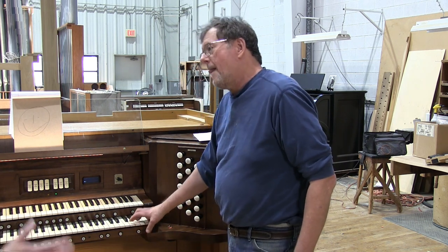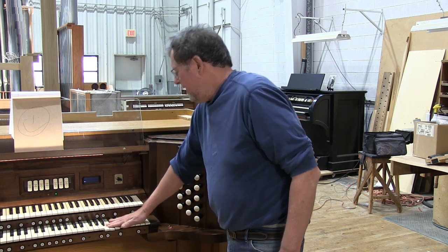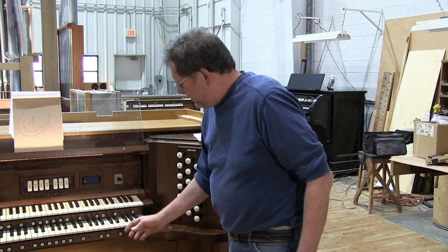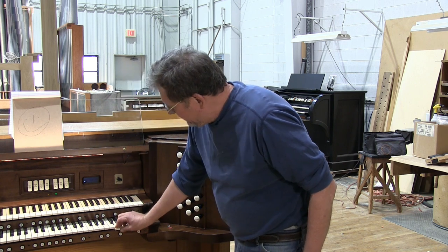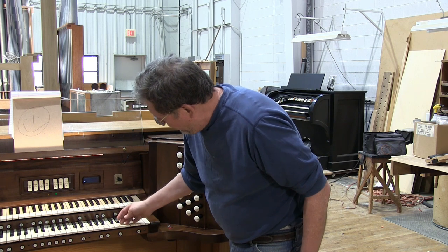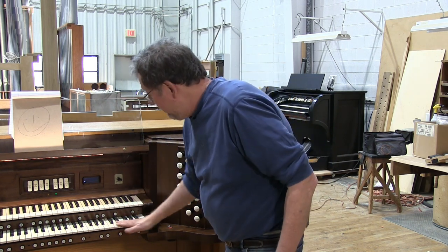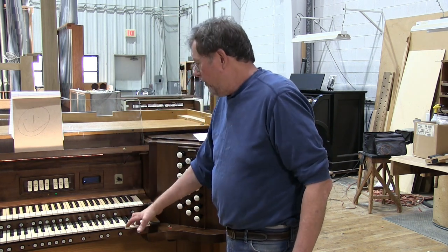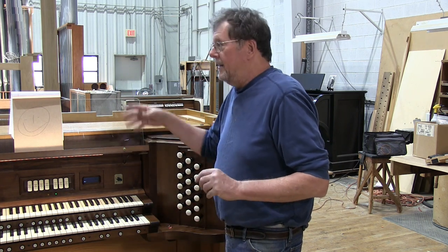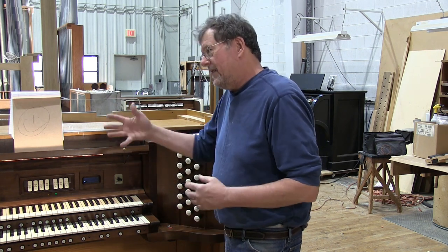Yeah. So what do you mean by simulating a year? It's an actual machine that presses the keys up and down for a certain amount of hours, and that sort of works in the springs and the felt, because there's a lot of felt that's pushing down. That's why it's not clanking, because there's felt hitting another board down there, and so those get squeezed and squeezed, and then these aren't as level anymore. So we have to re-level them. We try to work out the kinks before they're on the road, and then a year later, we need to go back and work on some keys. It kind of cuts that time down.